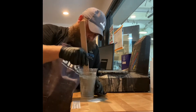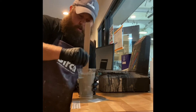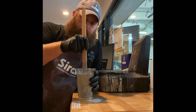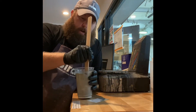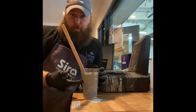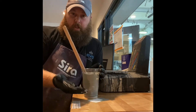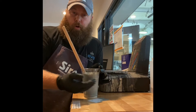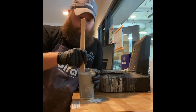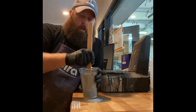We're just stirring it all up, making sure we're agitated all the way around. Once we get this stirred up I'll do the draw-down just to make sure it matches our previous color. I like to put a piece of tape across here showing how much is in there — the total base and then how much hardener they're going to need — just in case they get busy and forget what I told them.